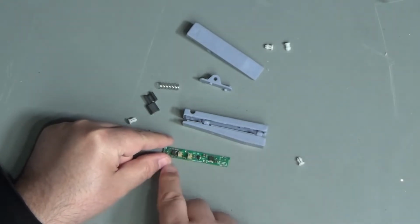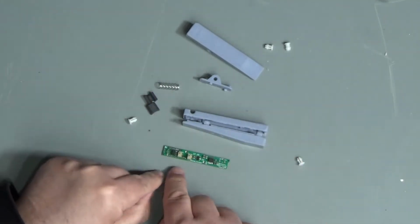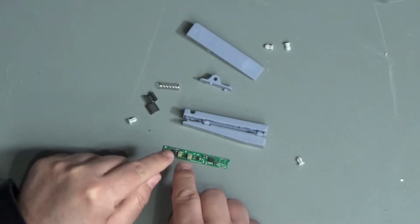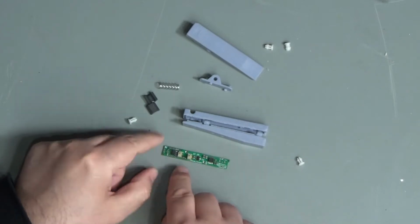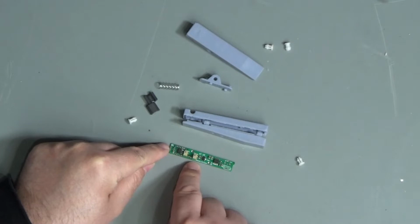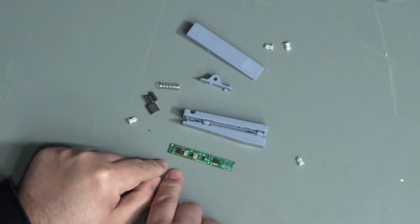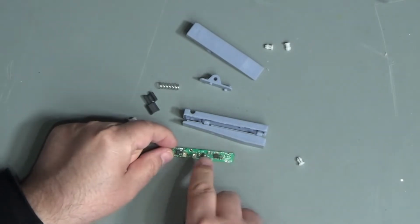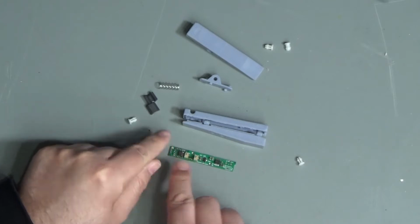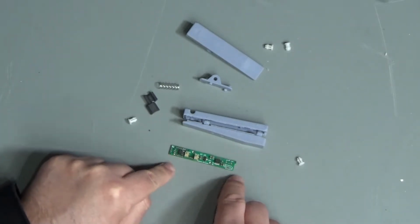So we've got the circuit board here, so I'm happy with that in principle. It's been through a couple of iterations of circuit design on breadboard. So first of all, I simulated it. It looked okay. I put it onto the breadboard, but I'd taken a few shortcuts to keep the costs down. And when I put it onto the breadboard, it wasn't thermally stable. So I've come back, I've altered this. There's a voltage regulator on here that didn't used to be on here. Higher quality trimmers, various bits and pieces like that. So all being well, this should now be pretty thermally stable.